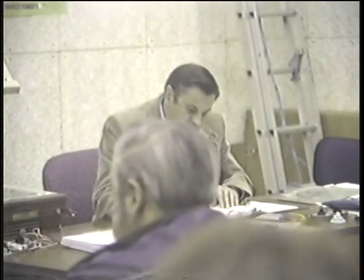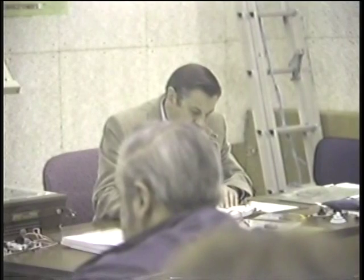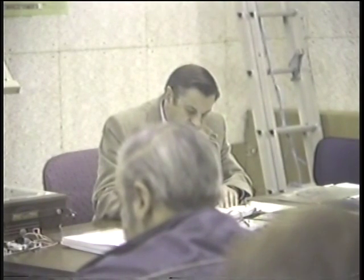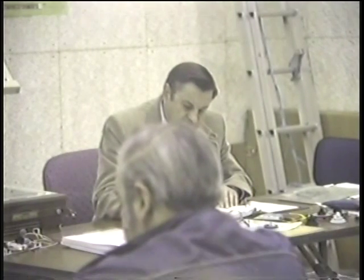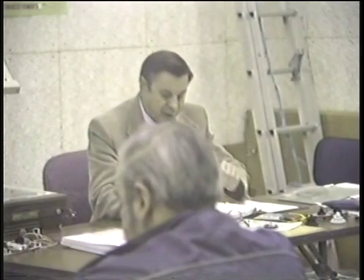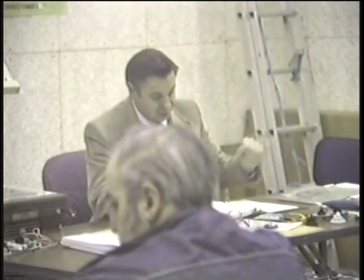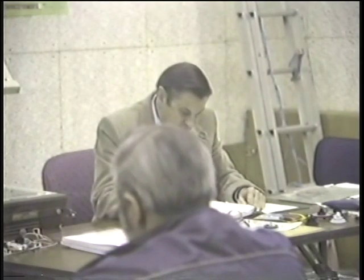Another important part of the editing system is the timing. And the microcomputer system will memorize both the start and end points of the insert to give very, very precise results. And then I've made the note that there's a 7-frame, at least on the machine I worked on, backup. In other words, it doesn't occur where you actually found it. So you have to determine how many frames to compensate for. But it does do it automatically, which is kind of nice.